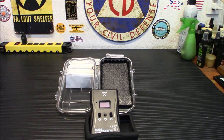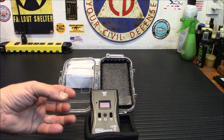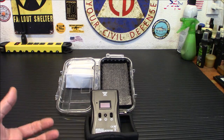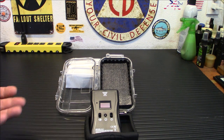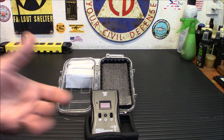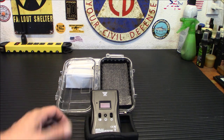So what's better about this one? Most professional-grade personal radiation dosimeters use a scintillator instead of a Geiger tube. When radiation interacts with a scintillator, it creates a tiny burst of light. Counting these bursts and how intense they are, radiation can be measured far more accurately than a traditional Geiger tube, which simply counts interactions. You get the individual bursts, producing a much more accurate radiation dose reading. Additionally, the bursts are very short, meaning high radiation levels can be measured — unlike a Geiger tube, which gets saturated very easily. Professional detectors using the scintillator typically cost around $1,000 and beyond, but the Better Geiger was designed for ordinary people at $129.